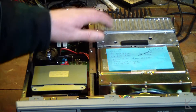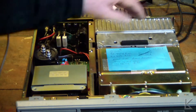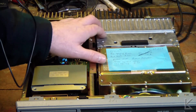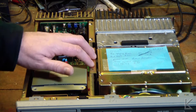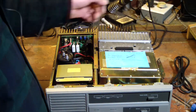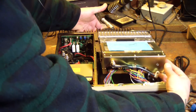Over here we've got the transmitter and receiver in a modular design, as I expected. Underneath there is a gap where I guess the duplexer would go — this unit does not have a duplexer. I would like to have seen that. The transmitter and receiver are separate modules but mounted together: the entire RF deck comes out as one unit.